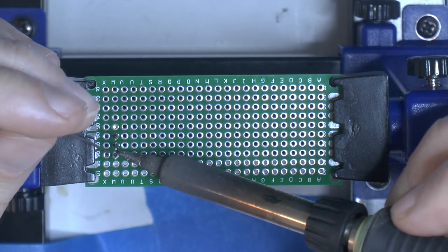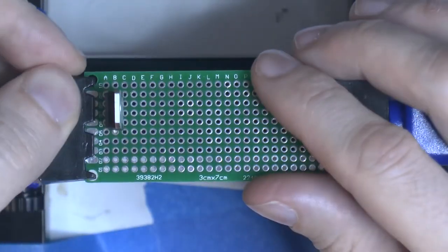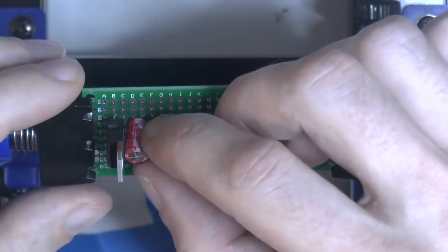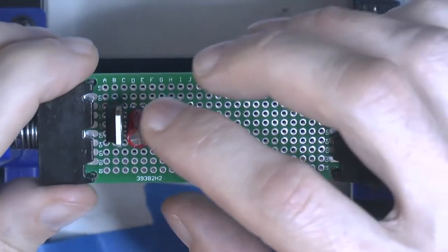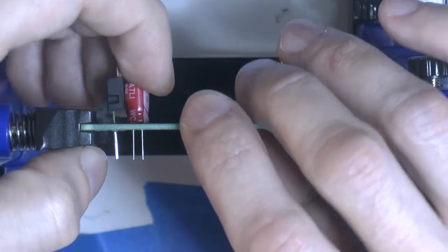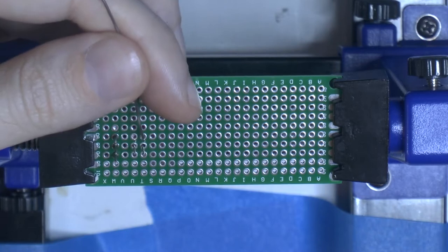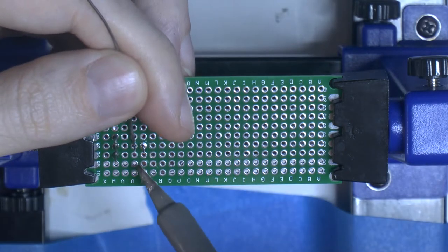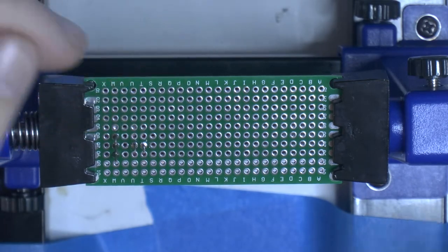They're pretty big so I don't have a heat sink on. With some airflow they'll stay cool enough, but if you want to run this passively I'd probably add a heatsink. If running passively I'd also mount the DC input cap somewhere further away. This is a 100uF 60V capacitor — I had to add one because I got horrible ripple on the 12V DC side otherwise, and we don't want that going into the rest of the system.